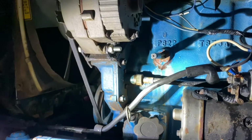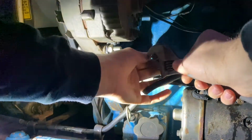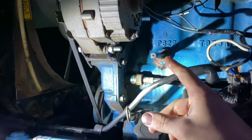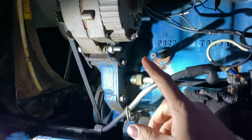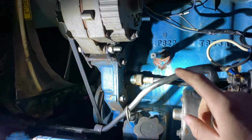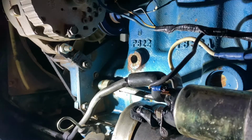Yeah, it's biting. It's still walking a bit. I'm gonna chip away a little more of the old stuff in there and then get this thing running correctly, and we'll get back when it's time to install our fix. All right, we've got that hole rethreaded. It looks good, felt good. Let's flush those metal chips out.